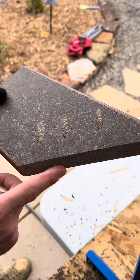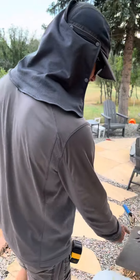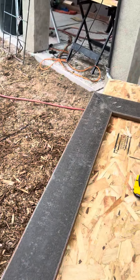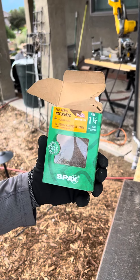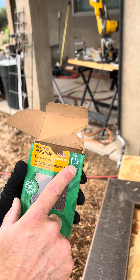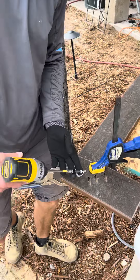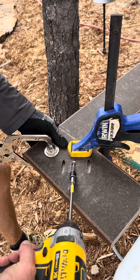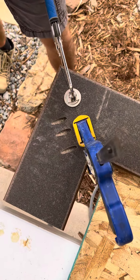We're trying to get one pretty tight to that inner corner, and just make sure you don't go too far out here. Then we bring it over here and clamp it to our nosing. I'm going to send these screws — I'm not paid by these guys, but this seems to be a good screw that works for us. SPAX, wafer head, inch and a quarter, won't protrude out. It's a T20 bit and I just send three of those. I usually send the center one first. Don't overdo it with your impact, otherwise you'll strip it.